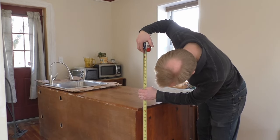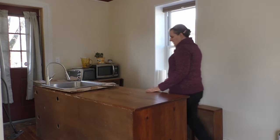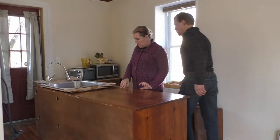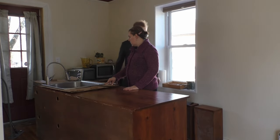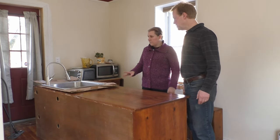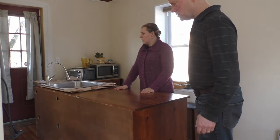It's 33 inches; the cabinet should be around 35 to 36, so I need to put an extender on — I think 2 inches. Our kitchen counter is 35 and a half. If you're watching the dishes you're bending over, so you definitely need a good height. We'll stick with 35. We need to move this against the wall and figure out the height, and the floor is not level at all so we need to level it. We probably need to cut the wall first to find those pipes.